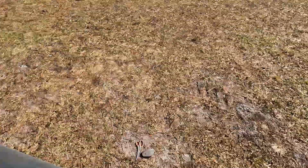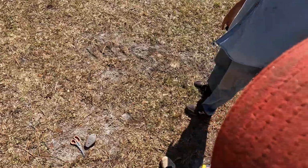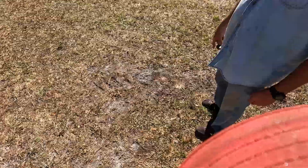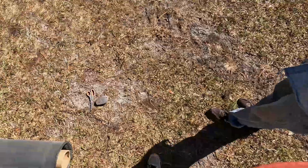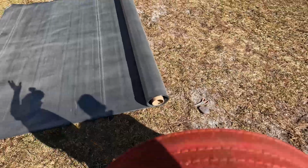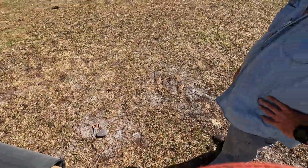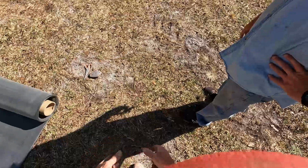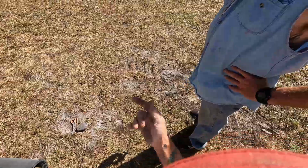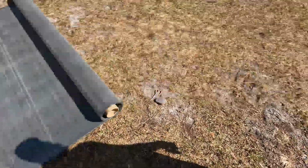But I want to have this thing done so I can go get another one started next week. Then I can come back to this one after that, because the other one's like 2 weeks out. That'll give me a week to get that one done. It's just the roof. Then come back here and do some things inside, remove that floor and bottom plate. I'm going all the way down to the flooring. I'm gonna remove the floor and the bottom plate, and I'm putting a 2x4 underneath them walls, just like we did everywhere else. That's my plan.